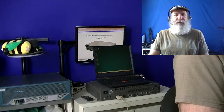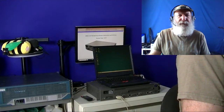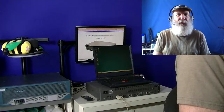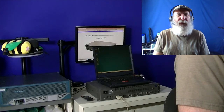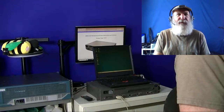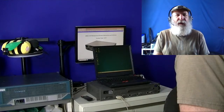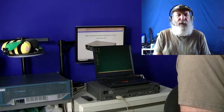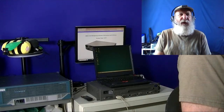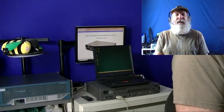But I thought, just for the other nature of the things, that I didn't find all of my coin cell battery stuff, I found one of the holders. I've got a grouping of items of the two types. I found one type of battery holder, but I've got my batteries and things like that in the other location. Just getting my low wattage soldering iron up here and getting into that unit and soldering in a battery holder. That'll back up that NVRAM, as I'm thinking that the battery is the issue right now.